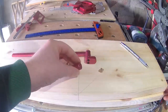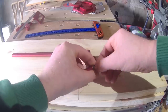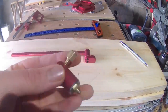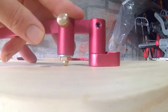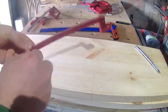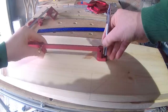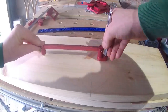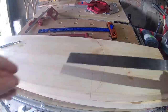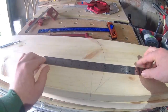The further out you go, the less this becomes an issue, but to eliminate it altogether is easy enough. The centering pin head itself unscrews, so here you can see me placing a small washer behind it. If we go in close, you can see that with the washer fitted the foot is flat with the rule, properly seated in the pin assembly. Setting the radius at 200 millimeters by counting back from the 206.5 millimeter mark — it's bang on.